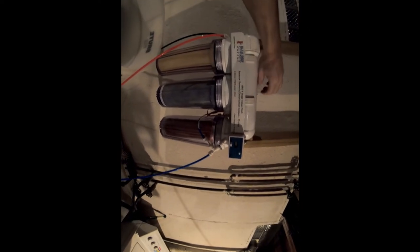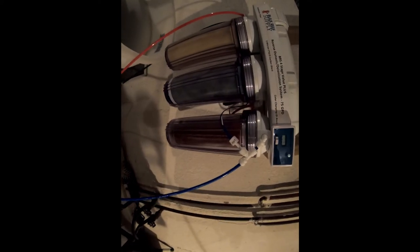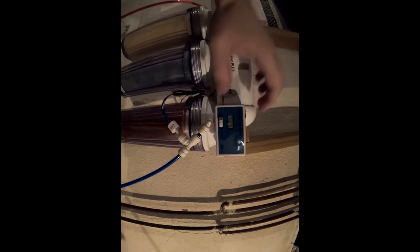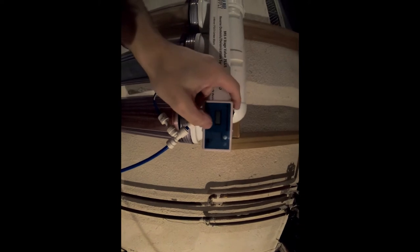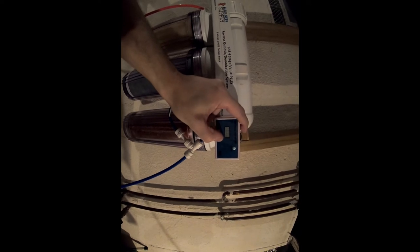It's been a good 20 minutes or so. Down to 9 total dissolved solids on the meter. Now we're going to flip the bypass lever — and now the water is flowing through all the stages. Watch that number, it's going to fall some more. Down to 8. And now the outgoing number: zero, zero, zero. That's what we're looking for. The water is coming out clean, but we're going to let it rinse for another 10 minutes or so before we start putting it in the garbage can.